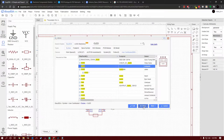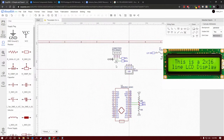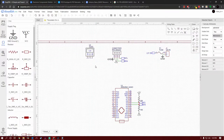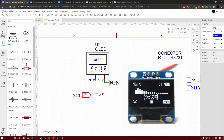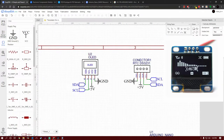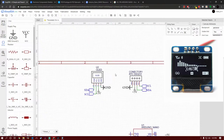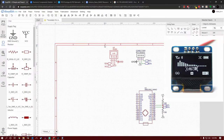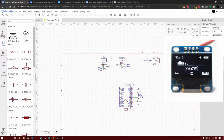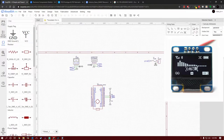If you recall from the previous video, I said we'd be using a 16x2 LCD that works on I2C, but I found something better, cheaper, and prettier — we're going to use this OLED. There isn't much difference in connections since both use I2C and are 5-volt compatible. I've chosen a nice picture of the OLED in the schematic, but you can use any 4-pin connector and it will work the same. I'll connect the SDA and SCL ports to its terminals. This is where you can see the benefits of the net label system — instead of running physical wires, we just connect the labels.